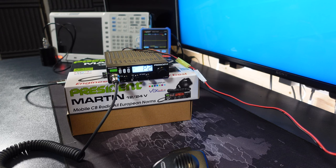I will revert this radio back to unmodified and run through those menus again shortly. Having reverted the radio back to unmodified or unexpanded state, we can quickly zip through the menus that are displayed. So we have PL — the FM low power adjustment — we have S which is the software version 1.0, the S meter configuration adjustment setting, the low power amplitude adjustment, and F2 which is the FM deviation mode. Those are the only settings available whilst in unmodified or unexpanded mode. To exit the services menu, all you need to do is turn the radio off and then turn the radio back on again, and we're in standard operation mode.